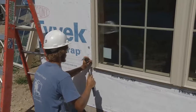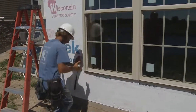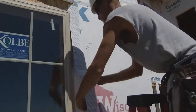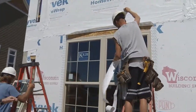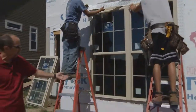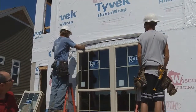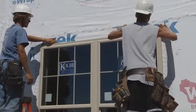The next step after the window is nailed off and secured is to tape the flanges. The tape is also a DuPont Tyvek weatherization system product and provides an added level of barrier against unwanted air or water penetration. You can see how they apply the tape over the top of the window flange on both sides. Notably, we don't put tape across the bottom nailing flanges because we want any unwanted water to have an escape path via the flexible rubber boot. On the top, they apply the tape right over the window flange directly to the wall sheathing, then lap the DuPont Tyvek wrap over the top in a layered, shingle-type flashing — much like shingles on the roof of a house.